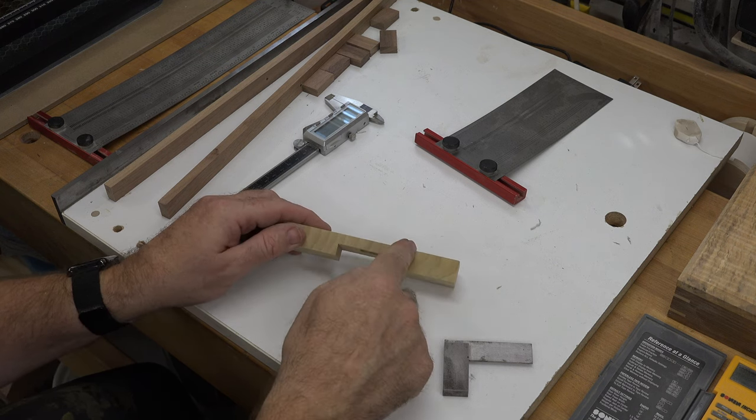So at first we need to look at this angle here and the hole. So the first thing we're going to do is drill the hole. And guys, I don't think we need a video of it. We're just gonna take the dimensions off of the drawing. It's a 1/2 inch up to center and centered on the 3/4 inch side, center punch and drill the hole. It is a 3/16 diameter.